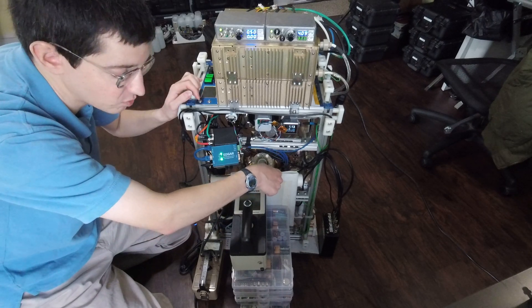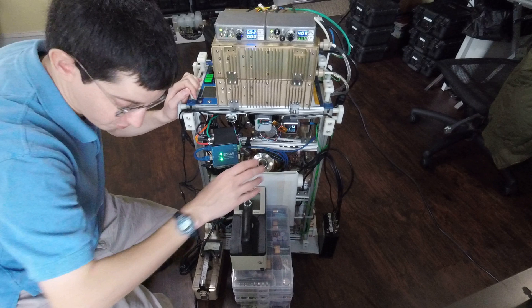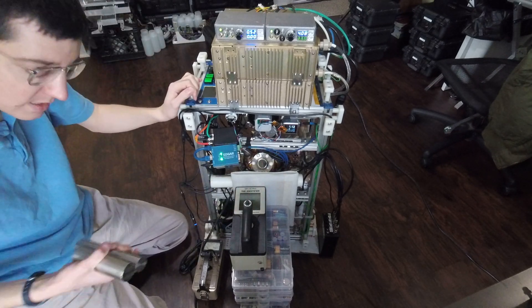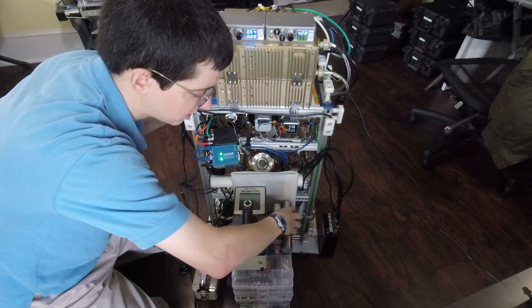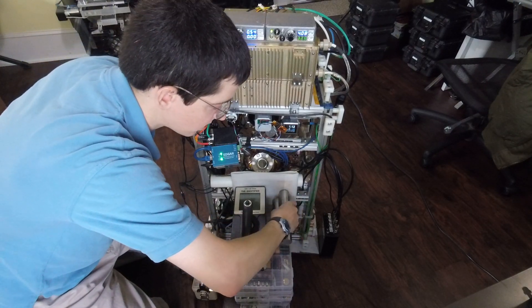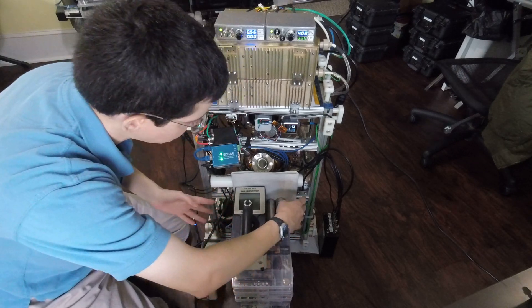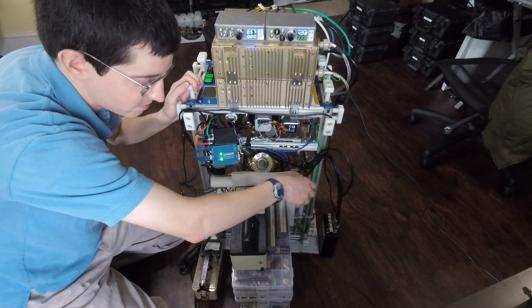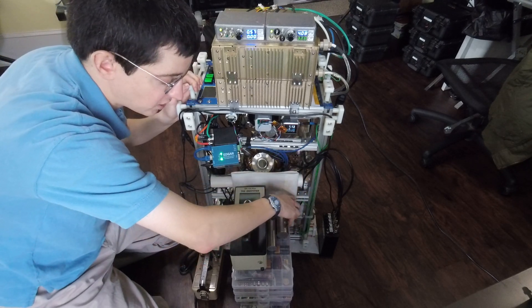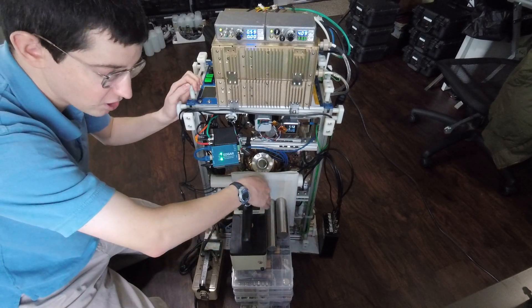So with an additional eighth-inch of shielding, I'm going to take some stainless steel bar stock and place it next to the GR135 Plus. The neutrons will come through the lead and strike the stainless steel, and that will generate scattering gamma rays which will be picked up by the GR135 Plus.